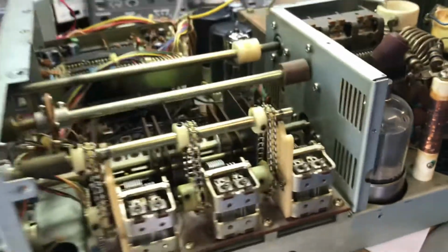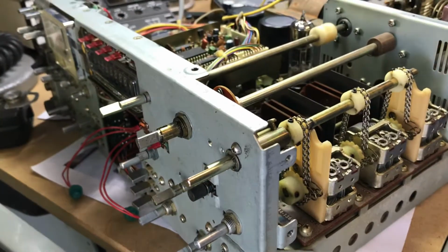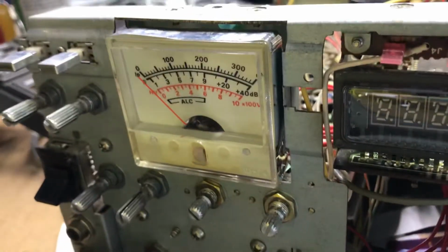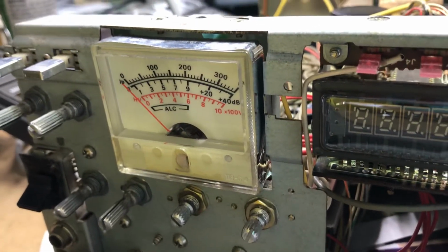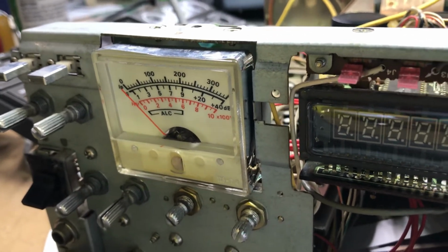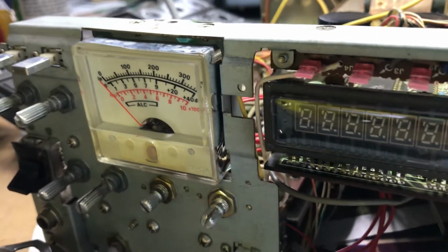And so the front panel is off and that has had a clean. All the knobs are getting a scrub, so it's getting a clean up inside and out, and then the electronic part of it as well. I have got the signal meter zeroed now with the advice I received. I desoldered the connections, took that out, pried it apart and zeroed it, so we're still to see if it's functional.